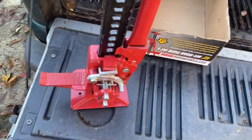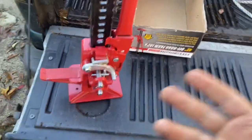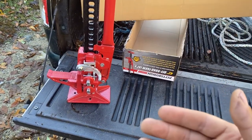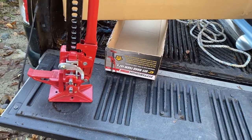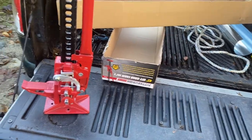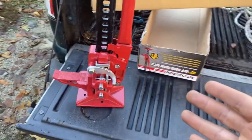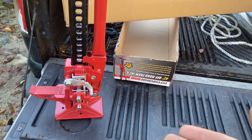Bought it yesterday, tried it today, and I'm going to return it today. Reason I'm returning it, it does not work. It'll go up just fine. Coming down is really sketchy. Under my own weight, it'll go up and come down just fine. No problems at all. I weigh 230 pounds or so, and I know I need to lose weight, but I'm nowhere near the 7,000 pound limit that this thing is supposed to be able to lift. So I'm glad it does work for light loads.